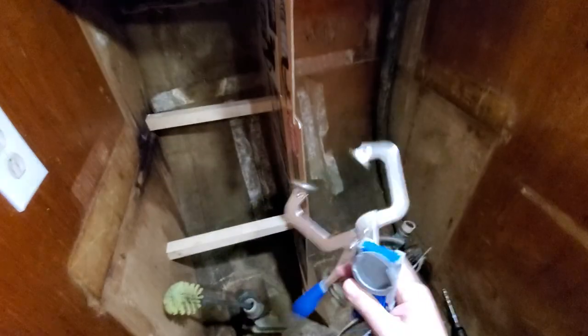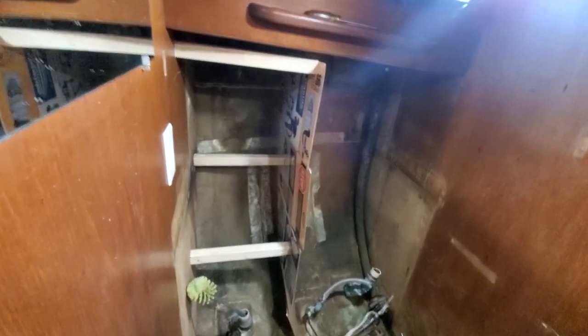I really like these a lot. And that just clamps on here with one of these big vise grip style clamps that they have. Works perfectly. And so then I was just able to take another one of these screws and screw that up on there. And you can see I've pretty well got this bulkhead mostly fitted. I still have to go in and make the piece that goes up on the top, and then that will get tabbed in here all the way around. And then I do have to have a little bit of a relief and clearance on that. So there'll be some fiddling with that, but almost have the first template done.